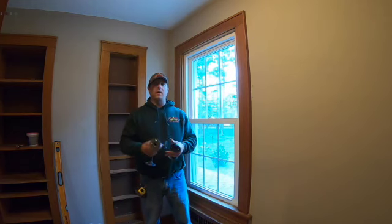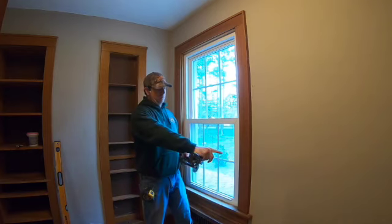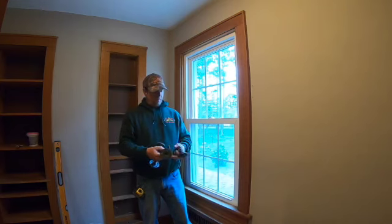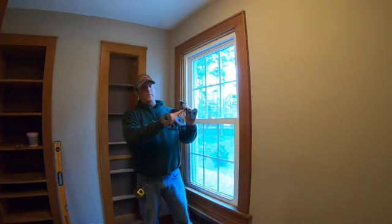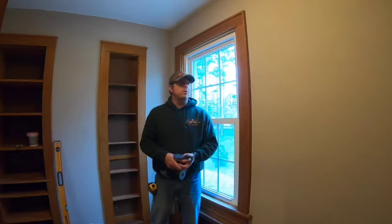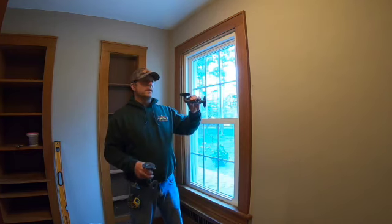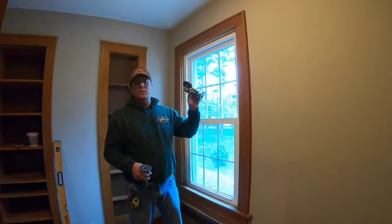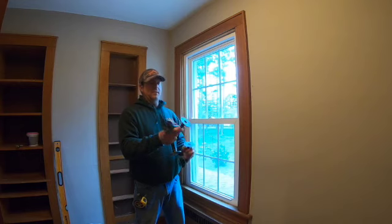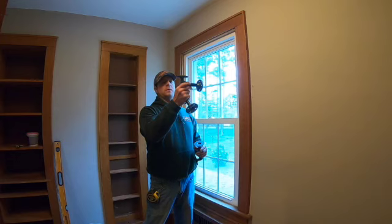We're going to put shelves across the top from this window back around, and then some lower shelves with these iron pipe fittings. We're also going to do some clothes hanger rods in between some of them. The shelves are going to be 1 by 10s, and we're going to mount a ledger board on the wall to mount these to, and that's going to be a 1 by 4, or basically 3.5 inches wide. I've pre-made these to fit from that 1 by 4 up to the 1 by 10 shelf.